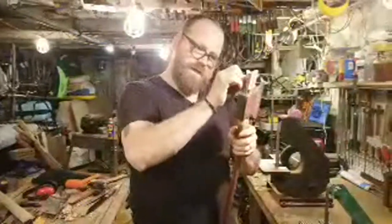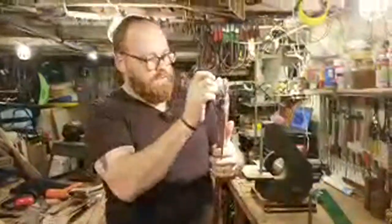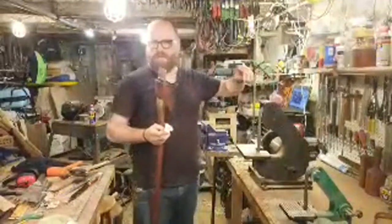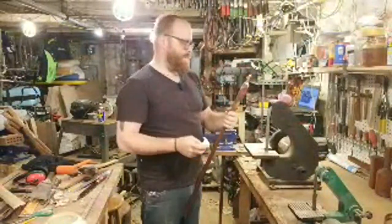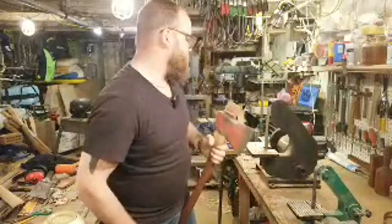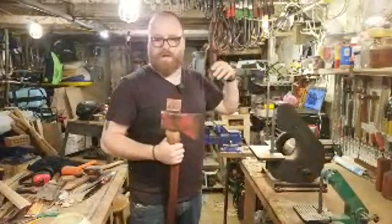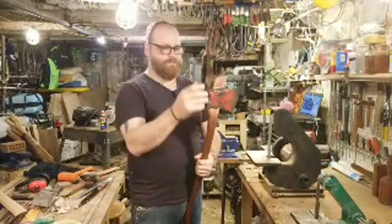The question earlier by Jack Tuttle was about the grit I put on my grinder. It's kind of a general purpose grit. This grinder usually has like a 160 or 180 grit on it, which is a good all-around use. It's rough enough to be able to take material off. But I'll switch back and forth between a 36, 60, 80, 180, 160, things like that. That's what stays on there. And when I'm doing more fine work, I have a couple higher grit belts and a couple polishing belts and finishing belts that I'll put on.